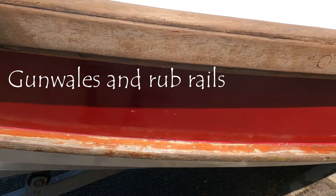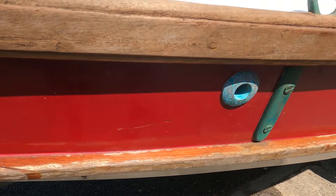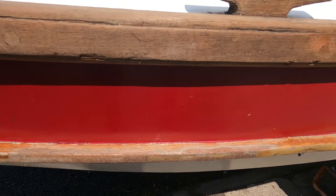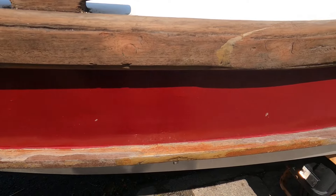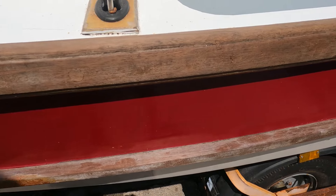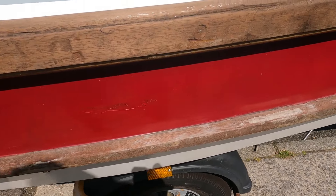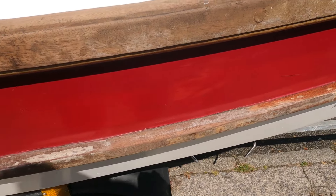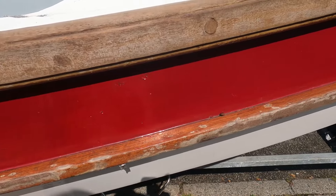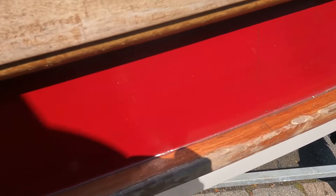All the rubbing strakes are mahogany — stained and gouged, they show 15 years of battle scars; a sign of a well-used boat, with a few encounters with pontoons, quaysides, rocks and even rogue floating tree branches. Treated in Burgess marine sealer every four years or so, and in the case of the lower ones, originally epoxy coated. They do need some TLC — some sanding back and resealing.